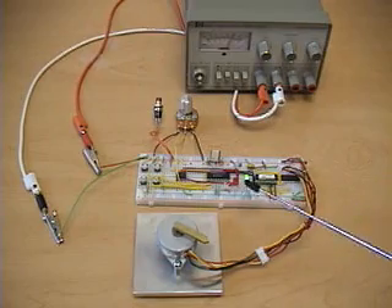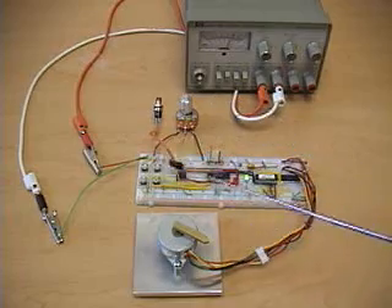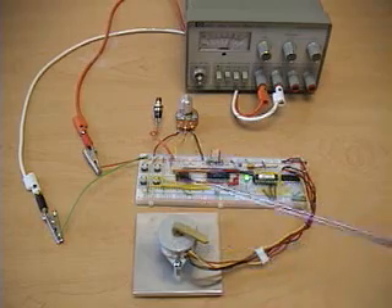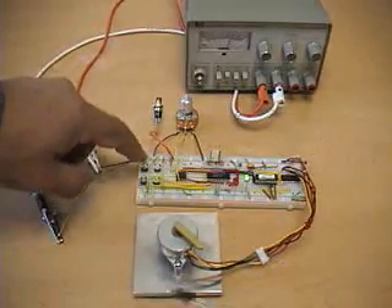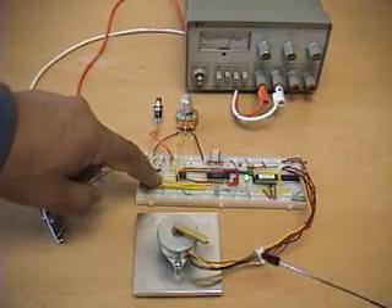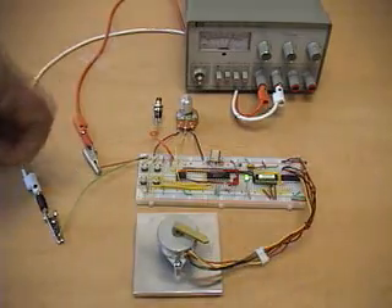Now we're back in position mode and the speed LED is off. The speed we were running at — which is very fast — is used to move to the index positions. It's important to note that if you try to move to the positions starting at zero speed and immediately jump to that fast speed, the motor cannot track properly and does not move the full 45 degrees or 180 degrees. It just buzzes in place because the motor is stepping too fast for the rotor to respond.